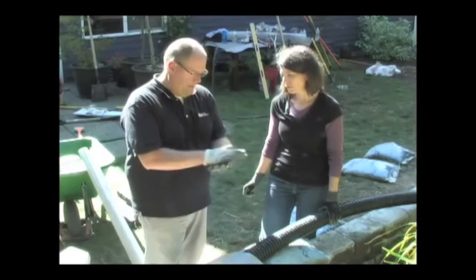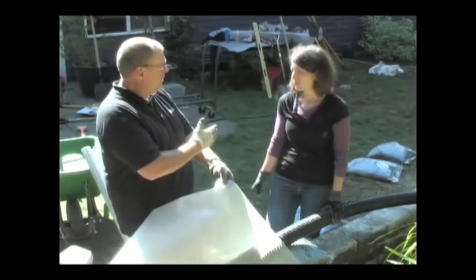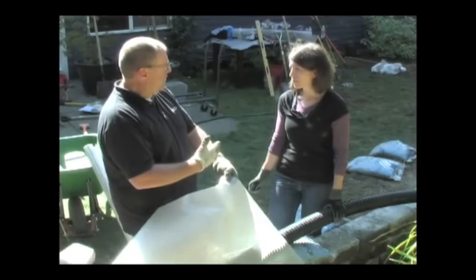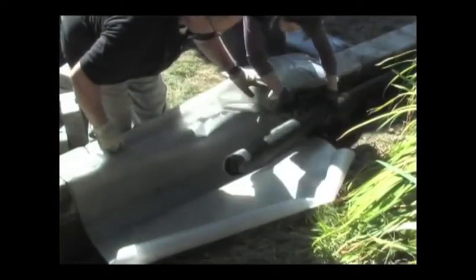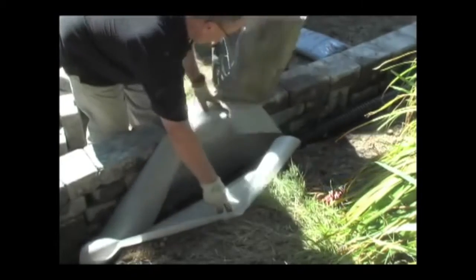The drain pipe needs to lay along the top of your footing. There's also a filter cloth — we don't want dirt leaching through the front of your wall, and you also don't want dirt leaching into your drain rock and clogging it up. So this is a filter cloth; it goes down alongside the wall, the drain pipe fits on top of it, and then it comes up along the dirt bank.